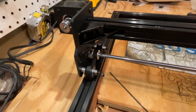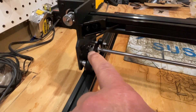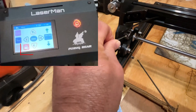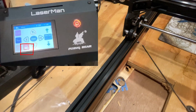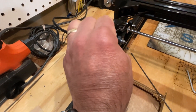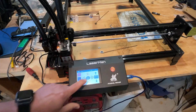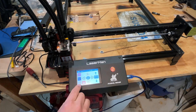It is time to set up our parallel X-axis. We need to go to the right side — I've spun this around. We need to loosen those two set screws. I've disabled the steppers so we can move things forward and back to get access to those two screws. There we go — both loosened. Now we hit Home and nudge it back.